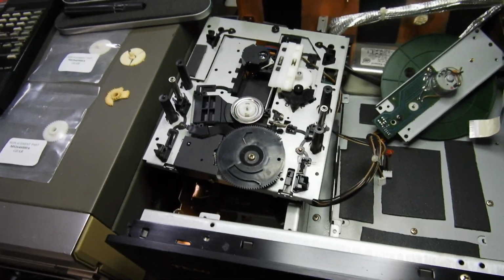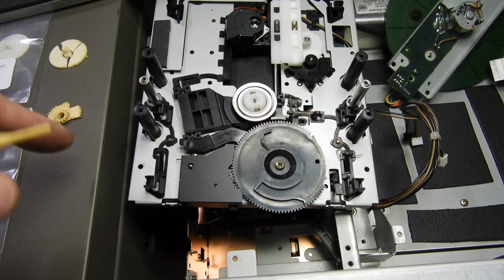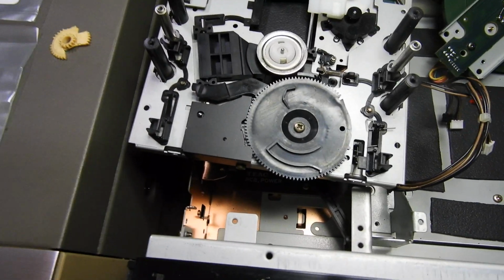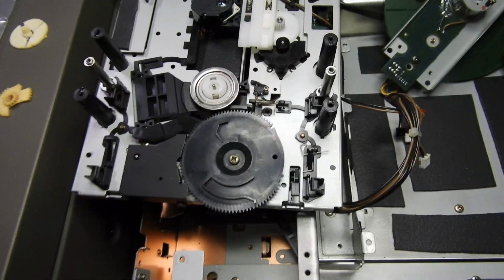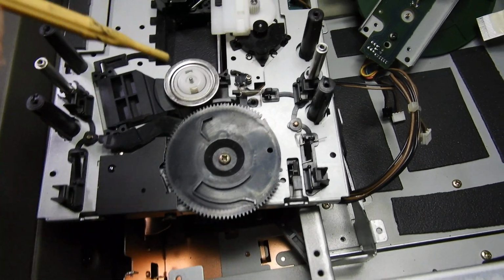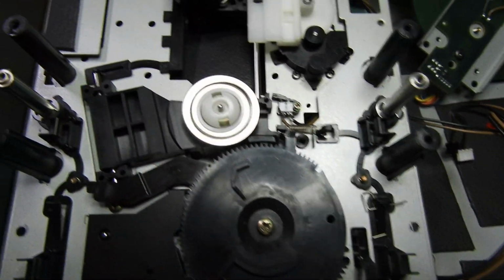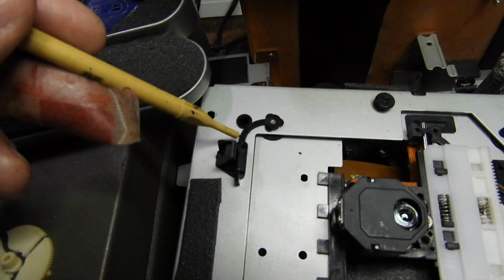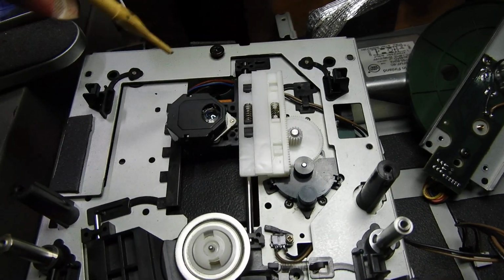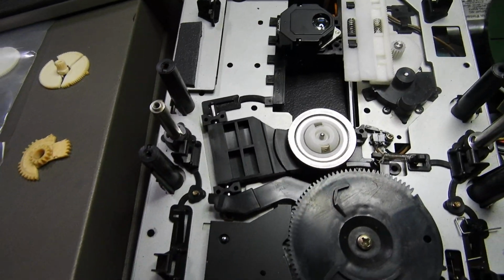One other thing that I need to point out to you, I think I've talked about it before, is that on those mechanisms in which on the metal chassis there's like a black substrate, or I don't know how to call it. When they fail, when all these forces go, it cracks those plastic traces, like you see. I don't know if you see, but there are a couple of cracks here. There's a crack there, two cracks on that. You just have to go around and look for another one there.